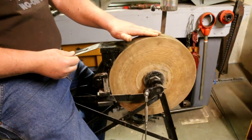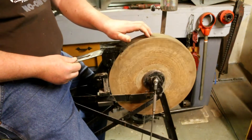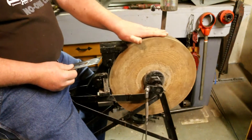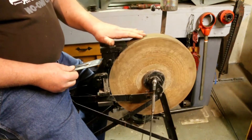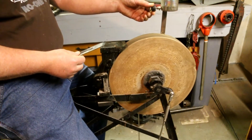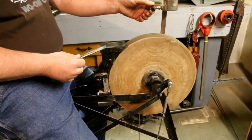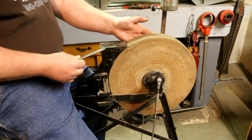With a large quantity of water on the stone it washes away all the swarf and also all of the slurry that is developed as the stone wears down. The sandstone is held together with clay, and the clay and the sandstone grind away as the wheel turns, leaving a polishing compound on the surface of the stone. So we're going to just dampen it a little bit and let this wheel build up a slurry.